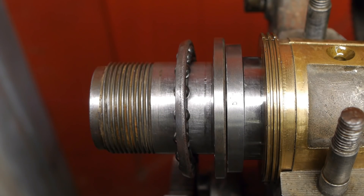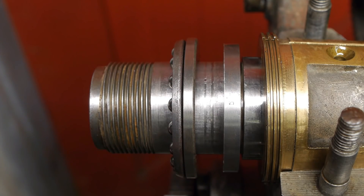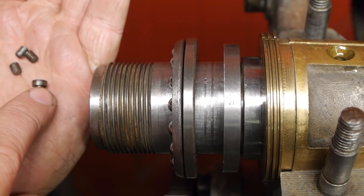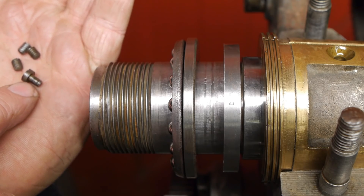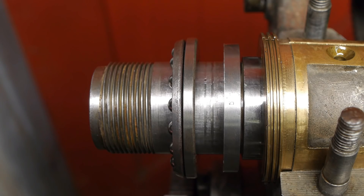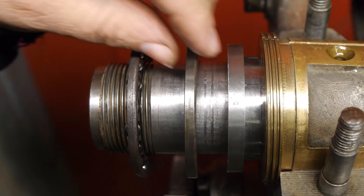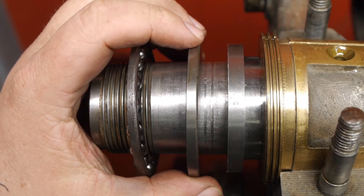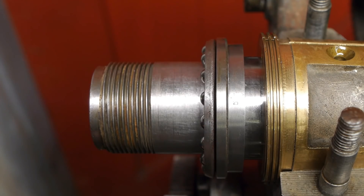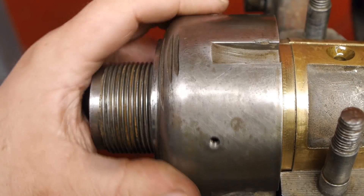But I think they should have been sitting against the ball race — that would stop it from spinning. They replaced one of the set screws and I think this is metric, but looking at the damage on the thread these are imperial. And of course I don't have any longer set screws that are imperial, so I think I need to order some, or bore out the end cap and re-thread it with something imperial. But what do you guys think — should this ball race be fixed to the end cap and stopped from spinning freely? I think it should, but I'm not 100% sure.